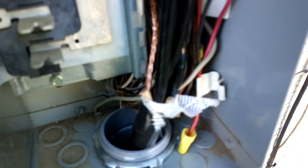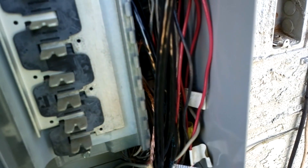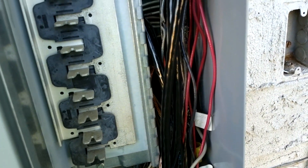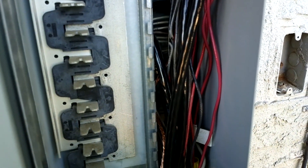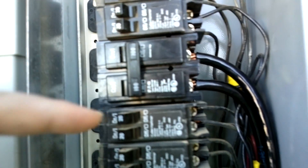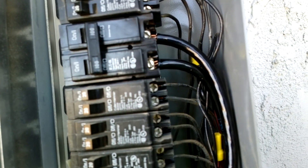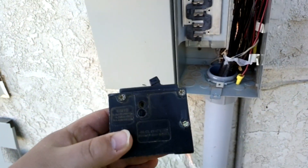You can see a copper ground through these black ones — it's two-wire. One wire goes to the neutral bus, one goes down to the ground bus. In the breaker we've got a 100-amp double-pole, so it gives you 240 volts into the garage. Screwed them in.